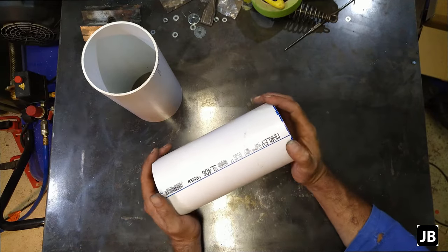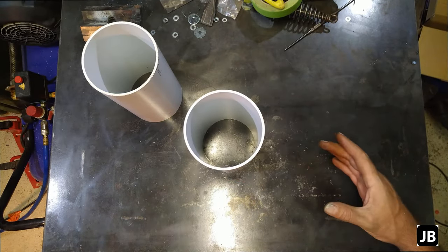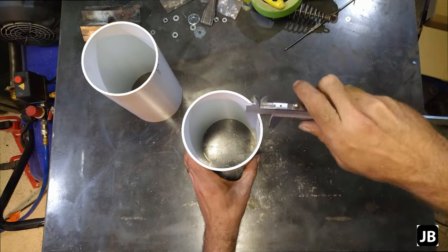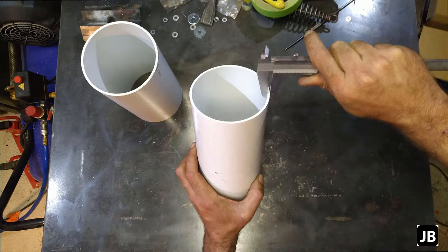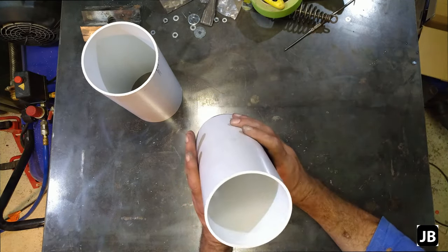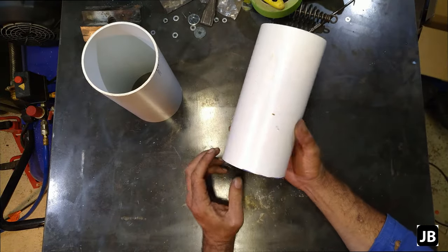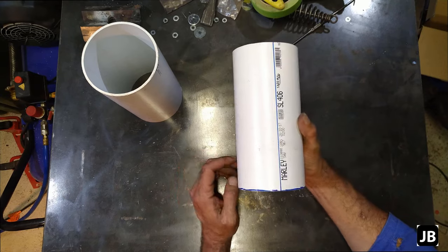What I've got here is two four-inch PVC pipe. Let me just check the wall thickness — it's normal drain pipe, looks like about 3.2 millimeters. Now every so often I need some plastic to do something, and I need sheets a lot of the time, so what I'm going to try is flatten these out to a sheet that we can work with.